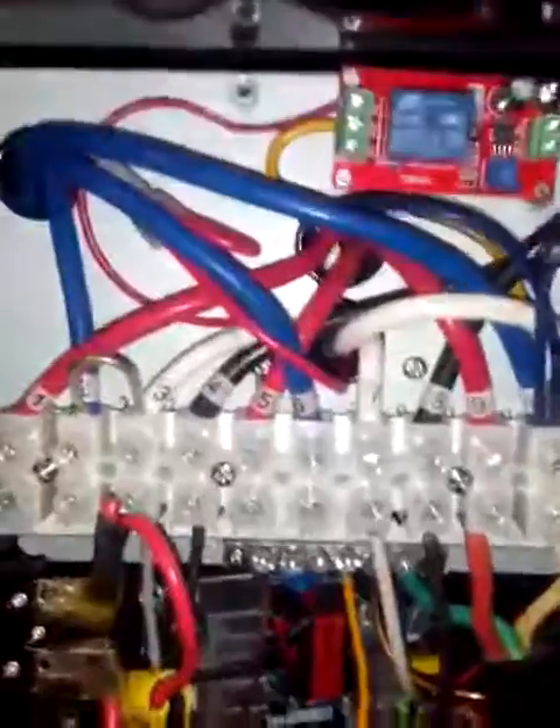I recently thought of a little add-on I could do — maybe a 100 or 200-watt inverter to do a double conversion. If I do that, I'm definitely going to need that 8-amp power supply. The double conversion will actually eliminate power going into the relays from the generator itself; it'll be more stable power, and the generator can just focus on powering whatever I'm running in the house. Anyway, hope you found this useful — have a good day.